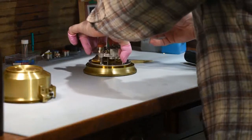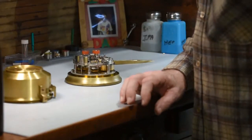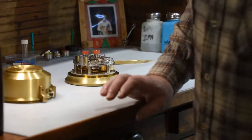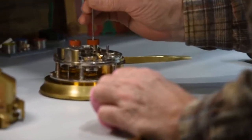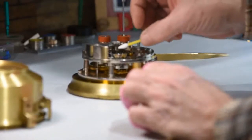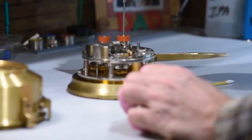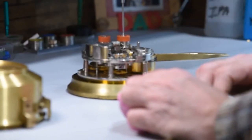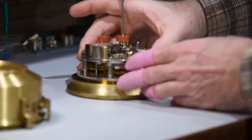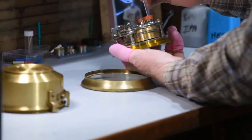This chronometer has a balance brake. If your Hamilton has one of these, you can use an Allen key to release the balance brake — and also to actuate it. All it does is this fork spring: the fork comes down and gently presses on the balance.